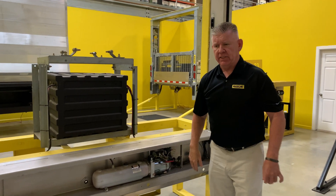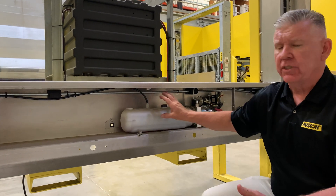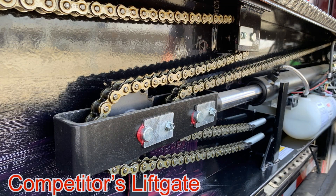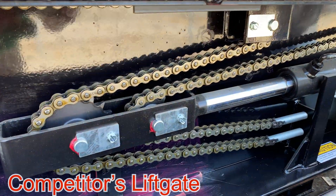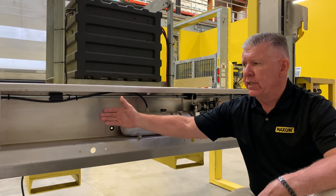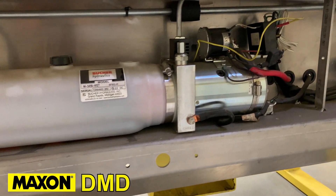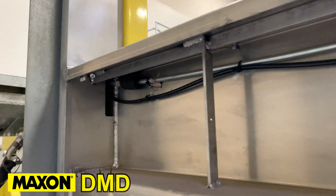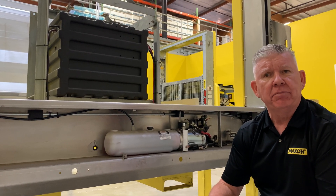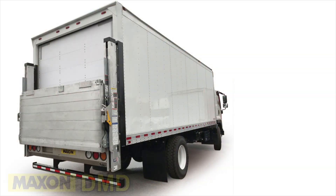Let's take a closer look at the DMD and what makes it evolutionary in its design. Typically, competitors' offerings in this marketplace would have a hydraulic cylinder housed in the mainframe housing, and attached to that hydraulic cylinder would be a series of chains and sprockets or cables and pulleys — all of which are additional maintenance requirements with prescribed adjustments and replacements. The DMD has none of those additional components. It simply has a pump and motor housing protected inside the mainframe enclosure, delivering hydraulic fluid through a series of hard rigid lines to one of two hydraulic lift cylinders located inside the column. The series hydraulic circuit that the DMD utilizes provides consistent level platform raise and lower operations.